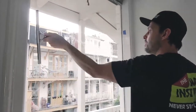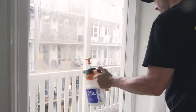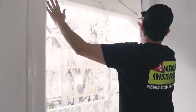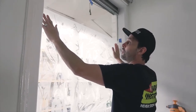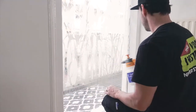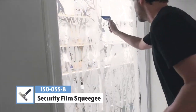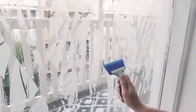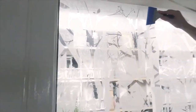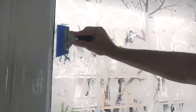Be sure not to place it on the ground. Spray the window one more time and squeegee it — just to double check there's no dirt on the window. Then spray it with a slip solution very thoroughly from top to bottom. Place the panel back on the window, unroll it, remove the liner, then make sure the top edge matches the markers on the right and left so it's perfectly level. Relax the material so it's evenly spread out on the glass. Spray the top surface of the film to allow the squeegee to slide across without scratching. Take the squeegee with the handle and lock it in from top to bottom exactly in the middle, always pulling rather than pushing. Then push the squeegee from the middle towards the sides, overlapping strokes so no water is left behind. Apply firm, even pressure and keep the squeegee angle at roughly 20 degrees.